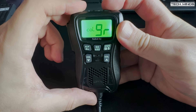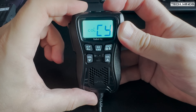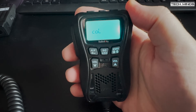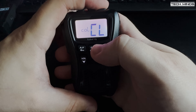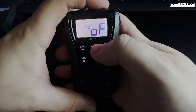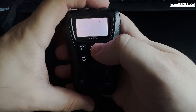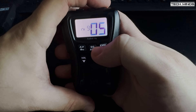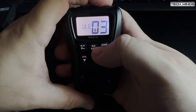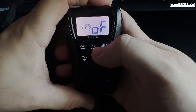There are a few color options to choose from and they're all easy to read — the weird lighting while recording made it look difficult on camera, but in real life it actually looks quite good. Going through the menu we can turn the button beeps on or off, then choose a roger bleep that sounds at the end of every transmission. The next menu allows you to change mic gain settings, then we have scan type — whether it's squelch or a timed scan.